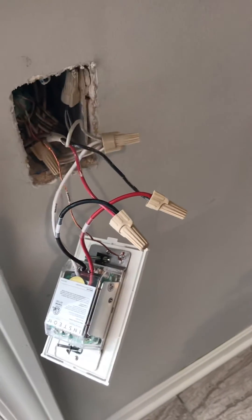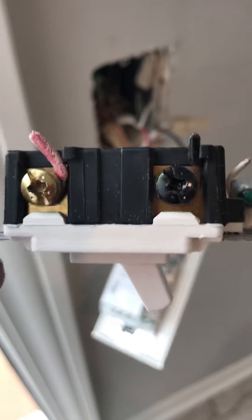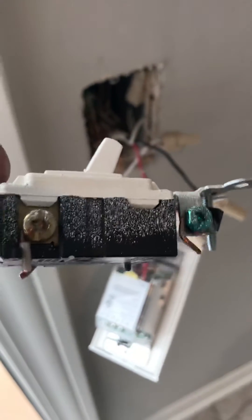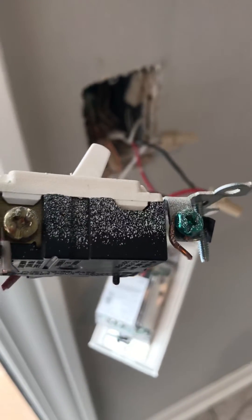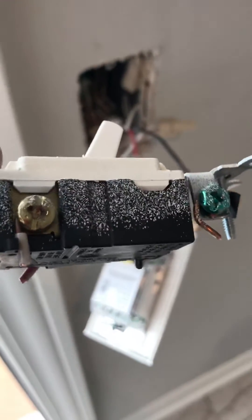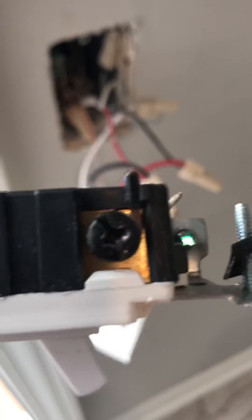Here is the switch that used to be there. One is a darker colored bronze screw and one is brass on one side. On the other side is another brass screw and my ground. Sometimes you may find the configuration on different sides where you have two brass on the same side of the switch and one bronze. But in any event, what we're trying to identify is what wire was connected to your dark colored screw or your bronze screw on a three-way.